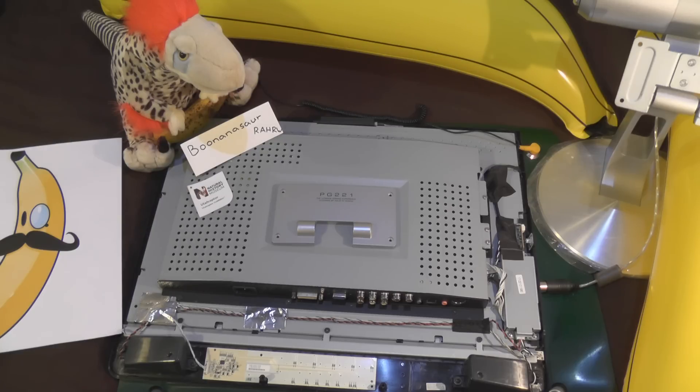Strike two for problem solving whether this was the monitor or not: we connected it up to other devices. We hooked it up to another PC, games consoles, DVD player, things like that. And every single time, exactly the same result. So it's definitely this monitor. Already I've got an inkling that it's probably going to be some kind of capacitors, and we're going to take it apart.